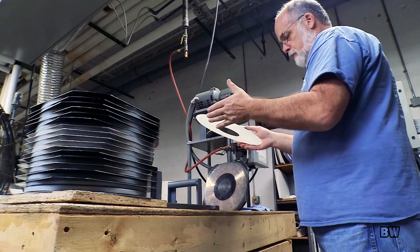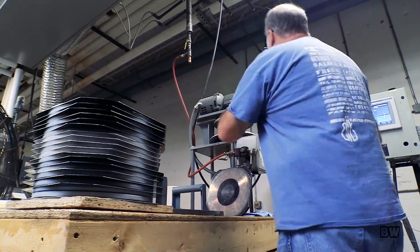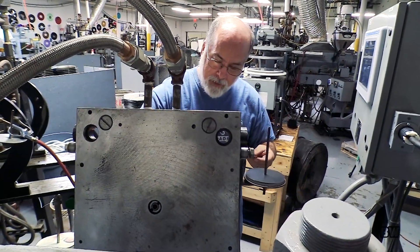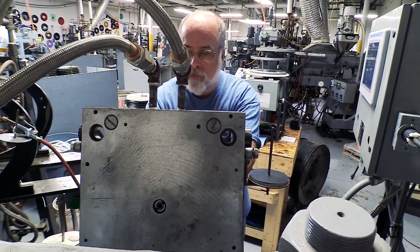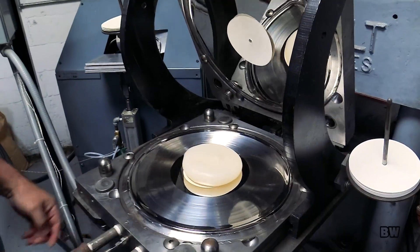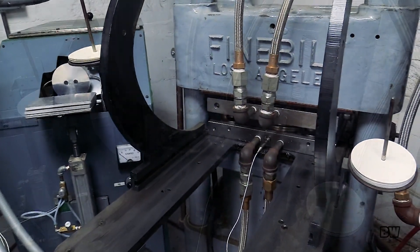There are all kinds of things you're looking for. Different variations in cutting depth, which relate to dynamic range, will dictate how the vinyl flows across the surface of those grooves. Sometimes, if you have a really quiet record that starts out very quiet and then gets loud, you can get a non-fill, which is the vinyl not filling the groove out on the edge of the record.